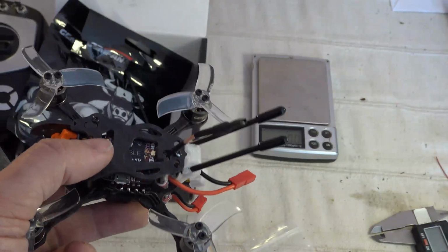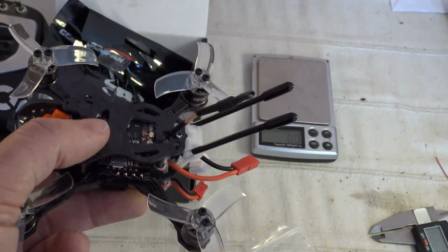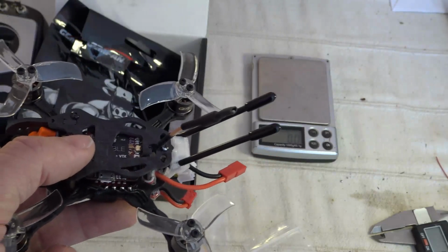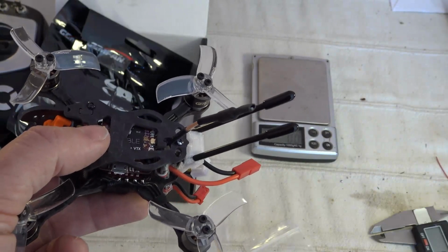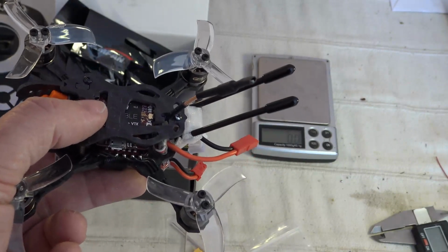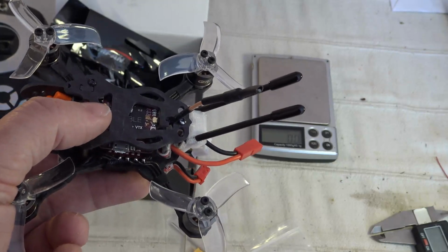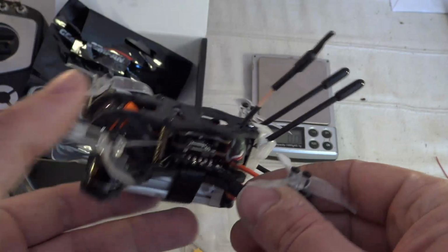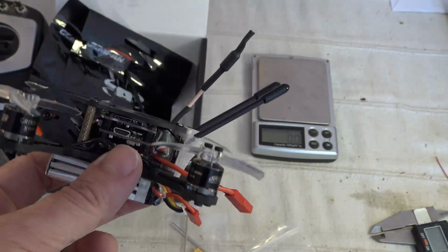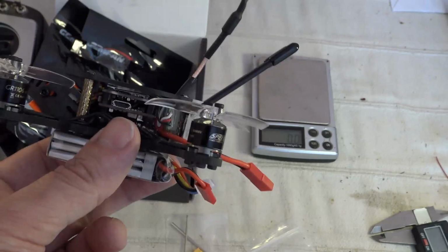And finally, I think you started to understand, in the V-band selection, if you press and hold this button one more time for more than 3 seconds, you enter the output power selection, and the LED will flash red. Okay, 1 light for 25 milliwatts, 2 lights for 100, and 3 lights for 200 milliwatts. Out of the box it's set to 25 milliwatts. But now, thanks to this protocol, you can change everything on the fly with some OSD commands I will show you in a few instants.